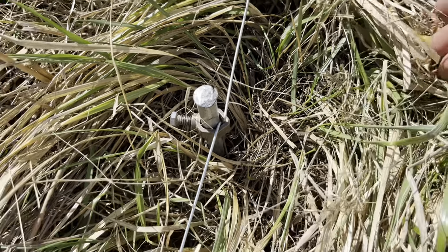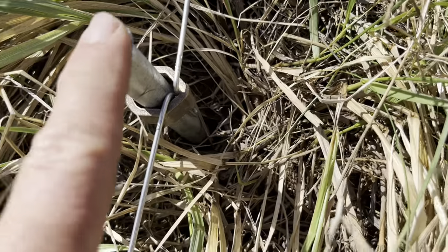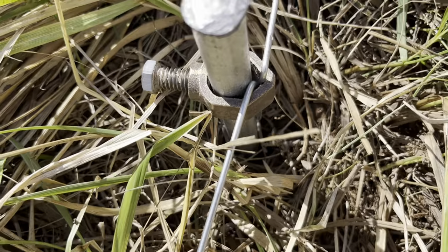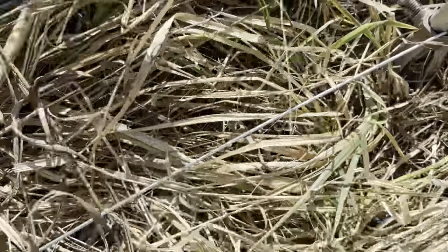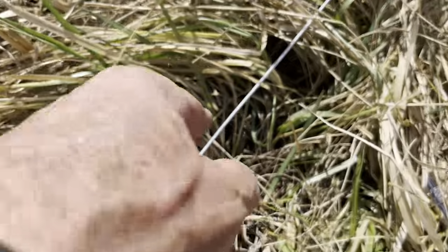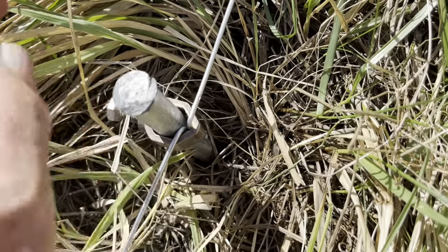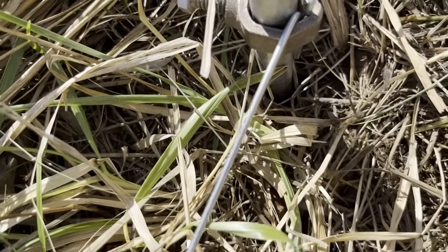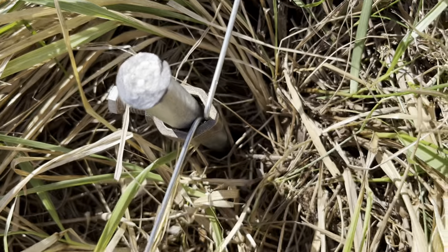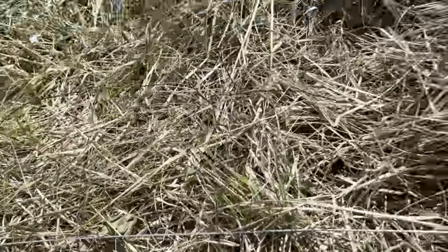Six times six — we got 36 feet of these ground rods. We got these from Paraflex and they have really nice ground rod clamps — those are not gonna bust off. We've put them in line right underneath our fence so there's no way you're gonna catch it with your foot. You shouldn't have any mowing equipment underneath your high tensile fence. We left them sticking up out of the ground about four inches. Folks, don't bury that in the ground because what you'll get is rust over time — you'll get rust at that interface — and once you get oxidation and rust you don't have a ground anymore, so you're going to have trouble with your grounding system.